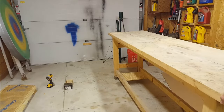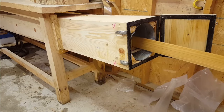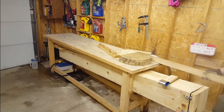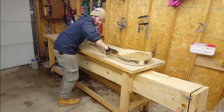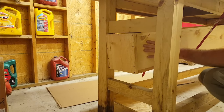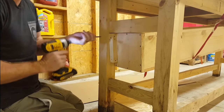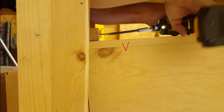One of my favorite things I did with the steam box is I installed it underneath this workbench. For me this is such a perfect situation because not only do I have a space out of the way for all of my steaming, but I can also use the top of the bench as the form for all of my bending. It was a bit of a challenge getting it installed properly under here — you want to make sure the whole box leans backwards just a little bit so the water drains out the back. I found a ratchet strap to be extremely helpful, and I used some blocking to screw everything into place.